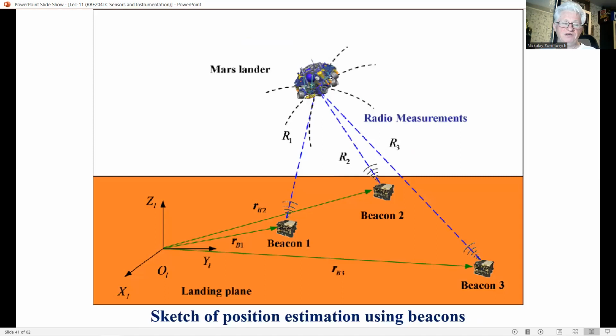Beacons for the determination of absolute position can be either passive or active. Passive beacons are, for instance, reflectors located at precisely known positions. The transmitters and receivers are located on the robot. Active beacons transmit signals that are received by the robot. Important design considerations are the directivity, or the scanning area, of the transmitter and receiver, the location of the beacons, and the identifications of the beacons. The robot must be able to recognize the active beacon.